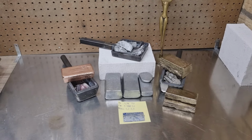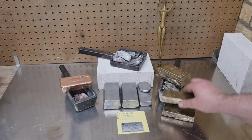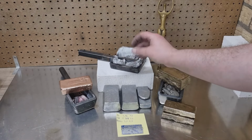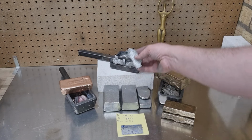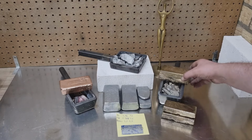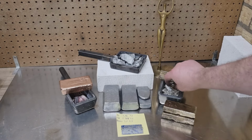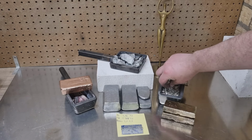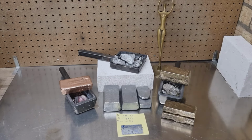So here is everything that I got out of this motor. I think brass is the winner. Second is aluminium. Now there is quite a bit of dross left. This stuff practically weighs nothing, so it's just foamy, bubbly stuff. Brass, I have a couple of somewhat useful pieces and a whole lot of little slag, or dross, whatever. All the dross I just keep separate, and at some point when I have a lot, I'll just make a couple more bars.